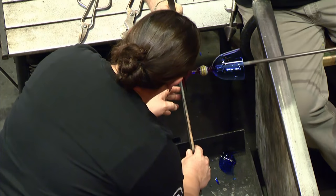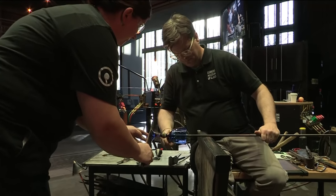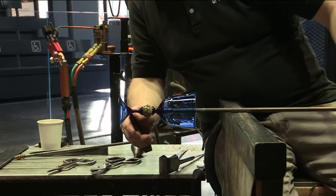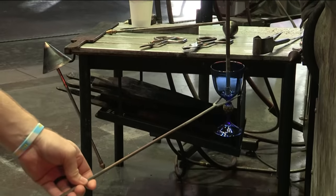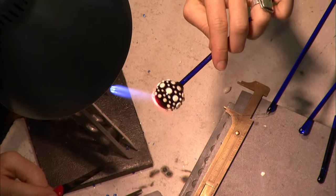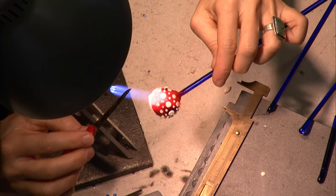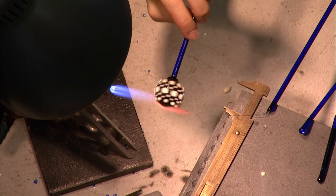We're just about ready to put this first cup away. All glass that we make has to be cooled properly, or annealed. So we're going to put this into our annealing oven, where it'll come down to room temperature nice and slow. Some finer adjustments, and then a light tap again. That dirty punty, the inside punty, should pop nice and clean away. And Dane will put it into our annealing oven. So you're at a nice 905 degrees Fahrenheit. If we don't cool that properly or anneal it, that would break in about 15 pieces in about 10 minutes.